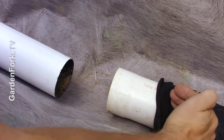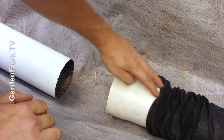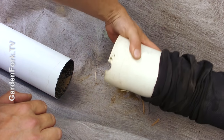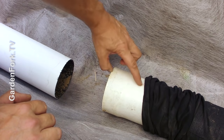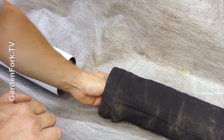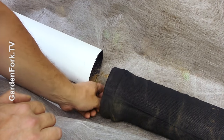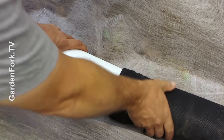I've done both ways and haven't really seen an issue with either one, but if you have, let me know in the comments. The pitch is going this way. I've got my last of my sock — this is the bell end, the wider end of our pipe — and our drain holes are pointed down. I'm gonna pull the sock over this, tuck it in, and then take our solid drain pipe that's gonna take the water away.